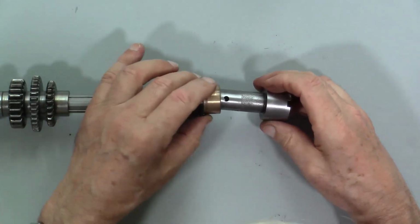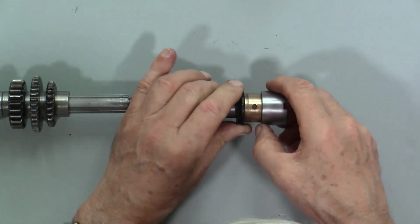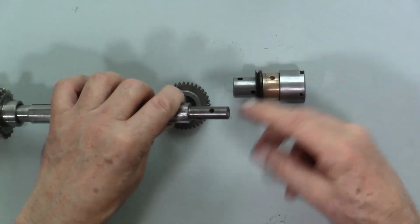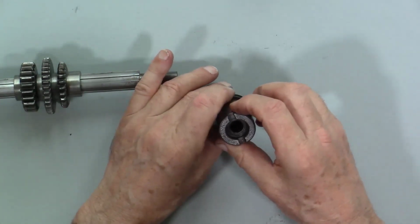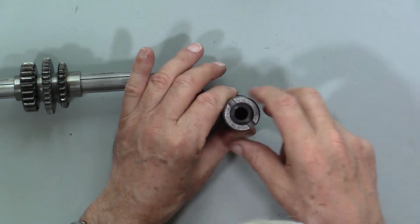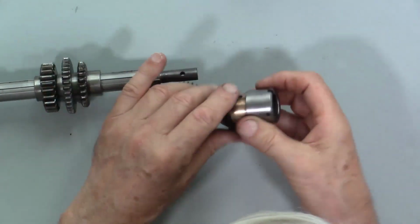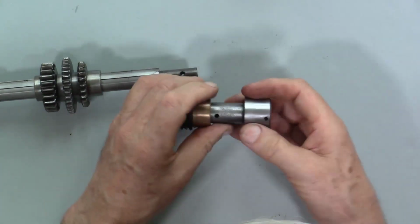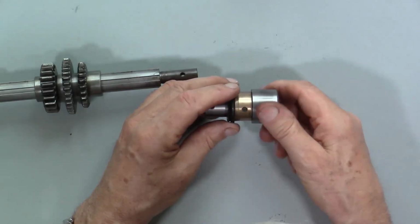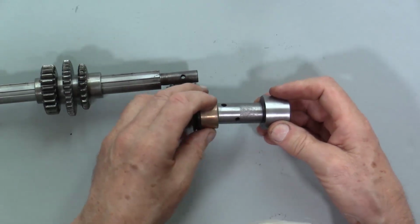this bearing. So the bearing is effectively, unless it is lubricated outside by spraying oil on here, and there's nothing in the lubrication instructions to tell you to do that, sealed. This shaft, by the way, is blocked here. So there's no way, and also you've got the drive shaft fitting in here, going along the bed, but that goes straight through and is blocked by this shaft. There's no way it can pass from there to this OD. So this bearing is effectively running dry, or with whatever lubrication was put in it at the time of manufacture. And so it's not surprising that it has worn.